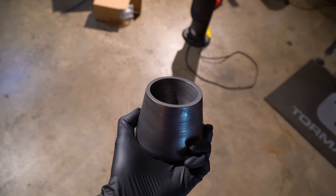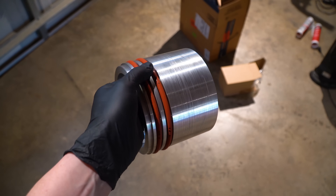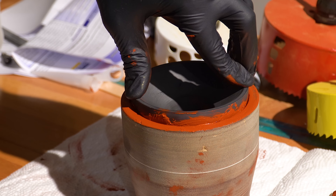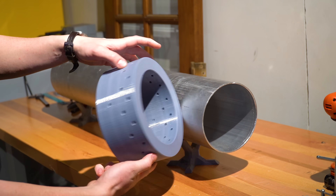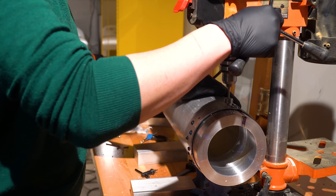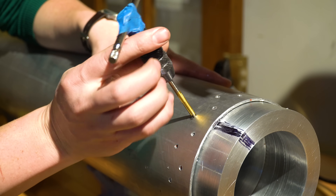It's time to put all these parts together using RTV silicone, which stands for room temperature vulcanizing silicone. This is like a very high temperature gasket maker, so it seals between the parts pretty well. First, I applied a generous amount to the phenolic insulator and the graphite insert, then compressed them together. Before I RTV the phenolic and graphite into the nozzle carrier, I need to drill out the radial bolt holes. The holes for the radial bolts cannot go all the way through the aluminum — if we put a hole between them, we allow some gas to get through if any can get through the RTV. Using a 3D printed guide to position the holes, I drilled all of them out, first on the motor case and then through the nozzle carrier. I also tapped the holes with M5 threads — the thread size for our radial bolts.